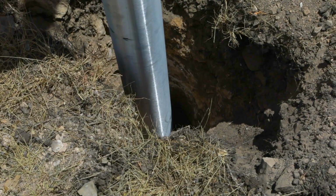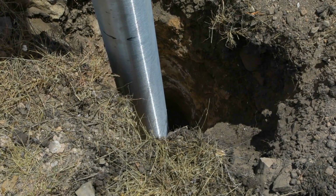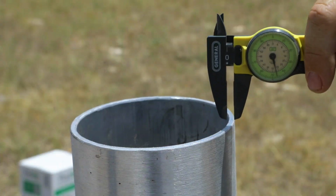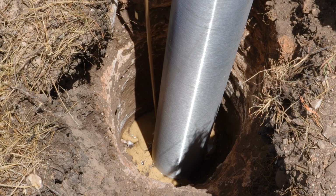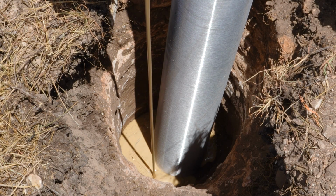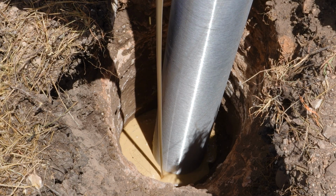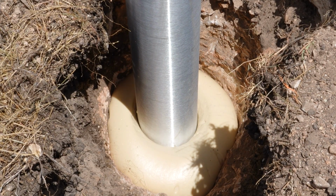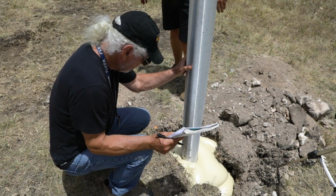In this scenario, a 6-foot section of aluminum .250 wall thickness pole shaft was used, however this time without a ground sleeve. The contents of the pole setting compound was poured based on the volume required. The compound was then allowed to completely set for 30 minutes under the supervision of Troxel Engineering.